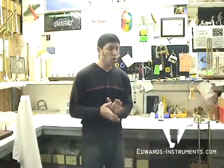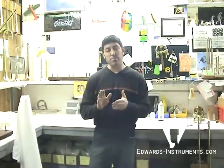Here at Edwards, we have so many people send their slides in, and if they had just properly maintained them, they wouldn't have had to send them to us. What happens is the slide will slowly degrade over the lifetime of the instrument if it's not maintained correctly. It's kind of like the brakes in your car. They're always slowly getting worse, and you don't even realize it until it's bad.